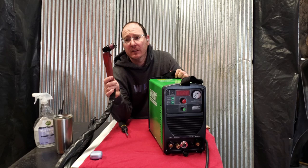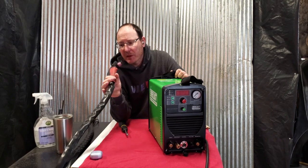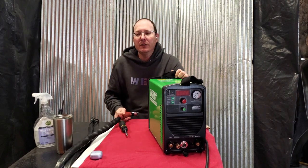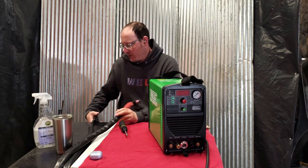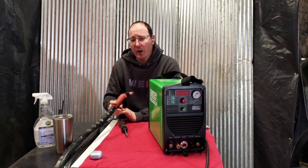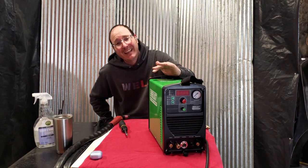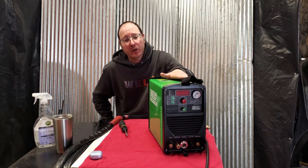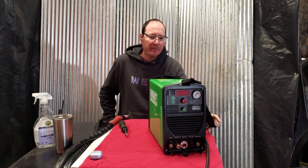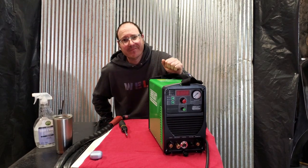So I wrote to the Everlast techs, and they sent me some tests to run on the torch because it was having a strange plasticky burning smell. I was hopeful that it was the torch, but we did a continuity test on all the connections, and the torch checks out so far. So we went back and forth, and now they have asked me to open the unit and take pictures of all the circuit boards. I've never done that before with this unit, so this will be a first — probably well overdue for cleaning, although I do take really good care of my welders. If it's a first for you, let's do it together and hopefully we'll all learn something.